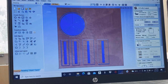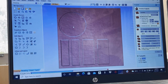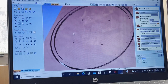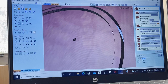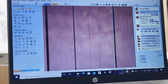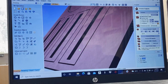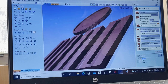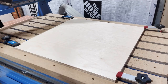I'm going to a 3D view here — let's calculate. And then if I reset everything and hit the preview, I'll zoom in and show you exactly what happens. You can get a better idea — here's the plate. When we go into a three-dimensional space, you can see how it's cut out. It's going to have a recess in here for the Lazy Susan to sit in, and the same goes for these recesses as well — the magnets will fit in there. I can get the background out to give you a diagram of what's going to be cut out. We've got a 24 by 24 inch piece in here, three quarters of an inch Baltic, and we're going to start putting our machine to use.